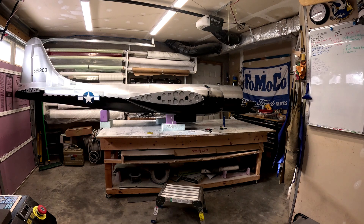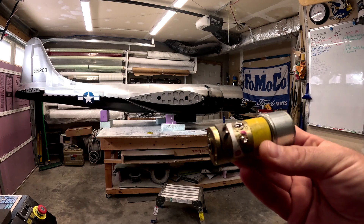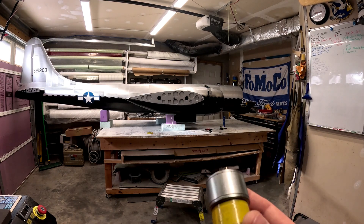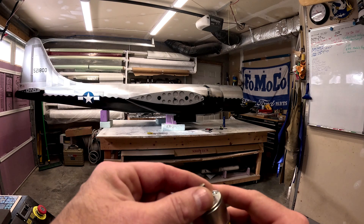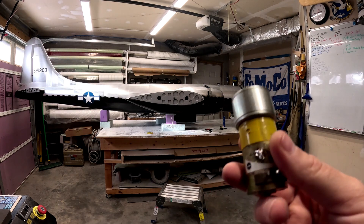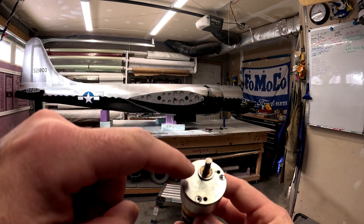What we came up with is these motors are made by Pittman, Kirk, or Ametek — something like that. It's an offset spur gear motor, about a 19-volt motor with a 19.5-to-1 roughly gear ratio, and the output shaft is about 4 millimeters. The new motors we found are 19.1 volts, 19.5-to-1 gear ratio, with the same shaft size.